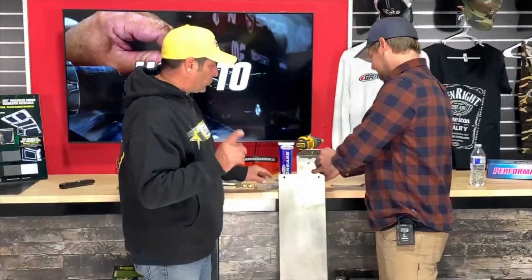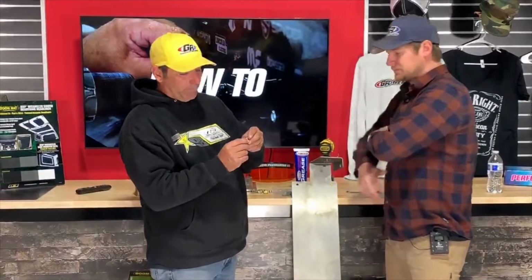One of the things that's kind of tricky is that the small one takes a hole that's just 1/64 over 3/8. Do you need to go buy a 25/64 drill? No. I hate to say it, but you can just wobble out the hole a little bit. That's what I did in all mine. What you want to do is make sure that this pushes in tight, even if it means you've got to tap it in with a hammer, because there's little knurls on this thing, and that's what needs to bite into the metal, so that when you're spinning it in, like we just did, the Rivnut doesn't spin. If the Rivnut spins, it's never going to take a set, and it's going to cause trouble.